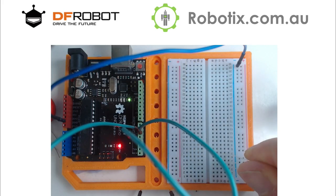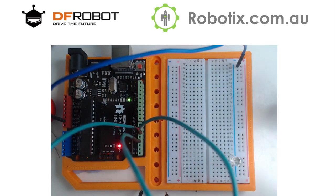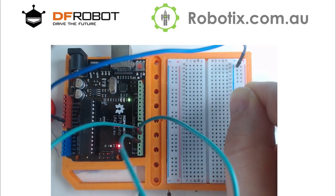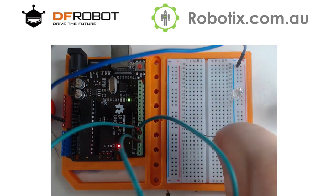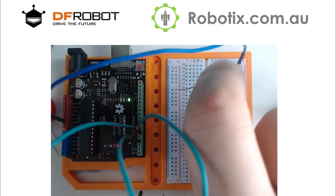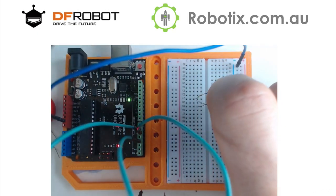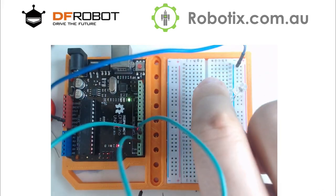And there it is. It's in. In fact, I'm thinking if I'm going to add buttons in the future or more devices at the start of the breadboard, I'm better off putting it out the back. So I'm going to put it all the way there. And I'll get these three, they're 220 ohm resistors. That one was wrong, but I'll do it correctly for this one. And that guy's going to move over one. And then up in there.